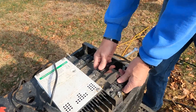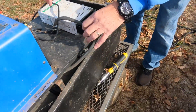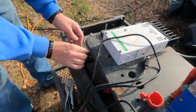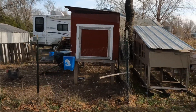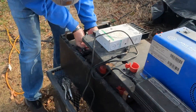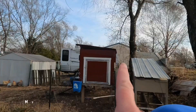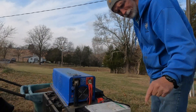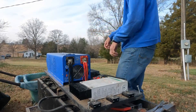The connections that connect the solar panel to the inverter are right here, so the first thing I have to do is remove those. I've already loosened those up and they're out of the way. There's one lead that goes to a positive on one and a negative on another — I went ahead and pulled those off. I've pulled the positive off of this right here, and the negative is off on the second battery over here. Now we'll be able to lift this whole thing up and put it off to the side.